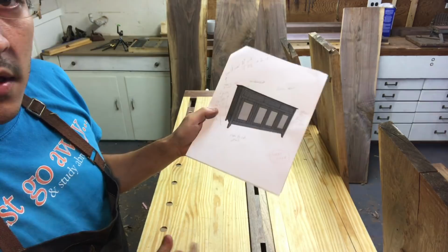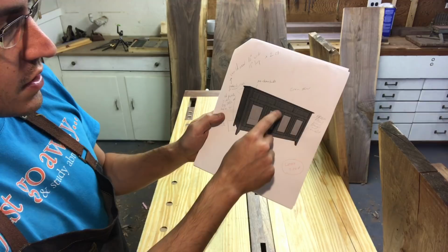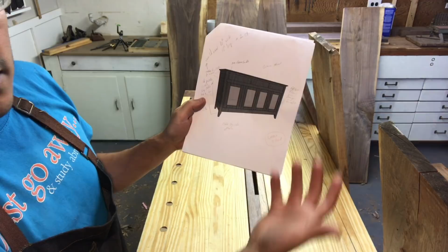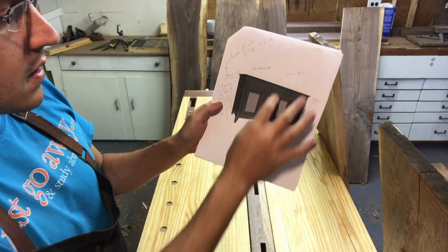On the horizontal ones on the front to be the same board. Not sure that's going to happen. I have, because that's 3 inches, 2 inches, and then 1 inch. And you have to account for maybe a half inch of cutting and planing for each gap, because it'll be like an eighth inch plus another eighth inch on each board of planing. So that's 3/8, which is almost a half inch. So you need another inch, I'd say, just that. So you need 7 inches wide just here.